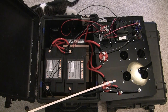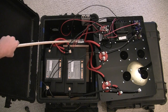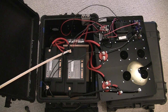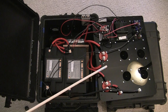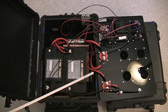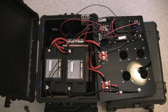Going over to the power studs on the other side — this side is for lower amperage, only 100 amps. There's a 100-amp quick-blow fuse underneath. I take the positive and try to stay within six inches of the positive terminal. I come off the other side of the fuse with the positive, go to the switch, and from the switch to the positive terminal. The negative goes straight to its terminal. This is basically how I wired up my solar controller battery box.